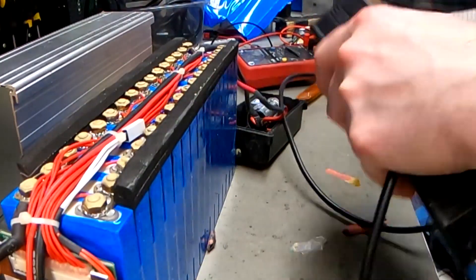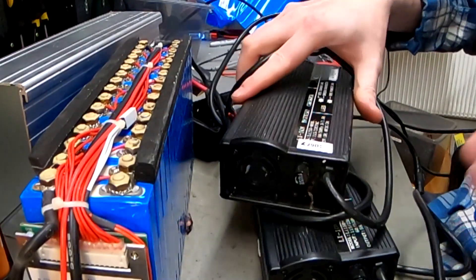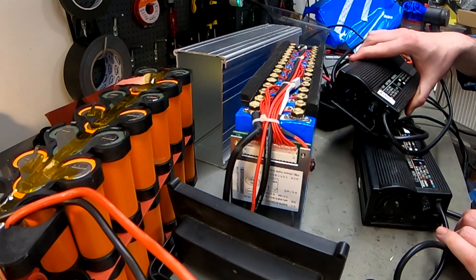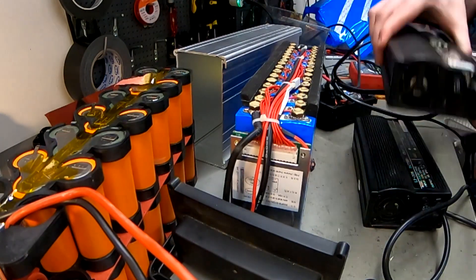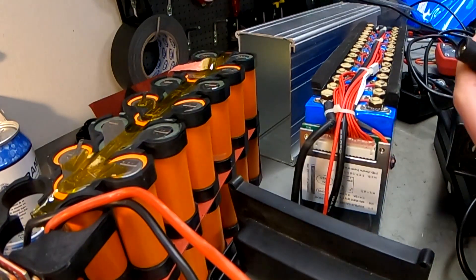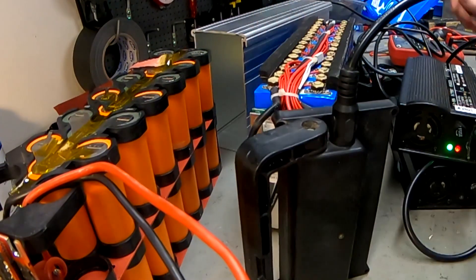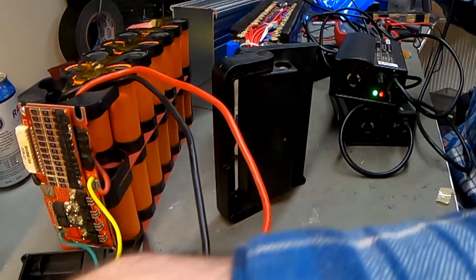They're dual batteries so there are dual chargers. I already see a problem — this battery should be 13s and he has been overcharging it to 58V. That's really not good. If this were a 14s pack, fine — so we'd have to replace it with 14s lithium for this to work. We have a green light and a red light. I've never seen a straight RCA connector with weather protection. It doesn't want to charge — no. So the cells are OK but they don't want to charge.